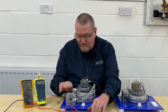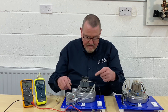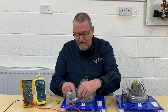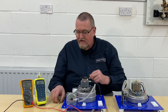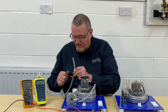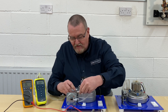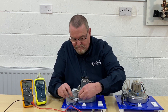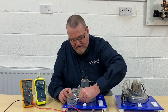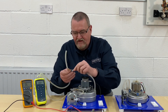I might check the Venturi's clear, because if it wasn't beeping, it could be the air pressure switch has failed or the Venturi's got blocked up. I've got a high-pressure tube — I'm going to disconnect that. On my manometer I've got a little T-piece, so I put the connection on there and that goes to the high-pressure side. Then I disconnect the other one and I've got another little brass T-piece.